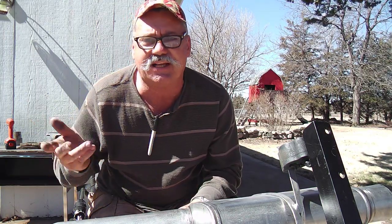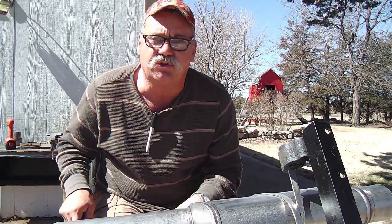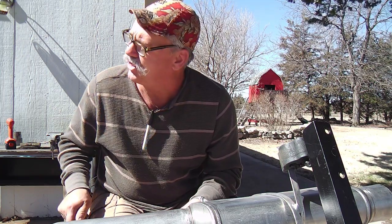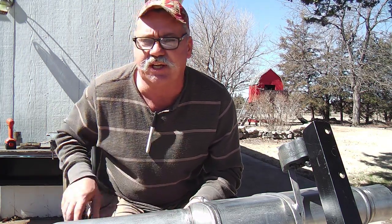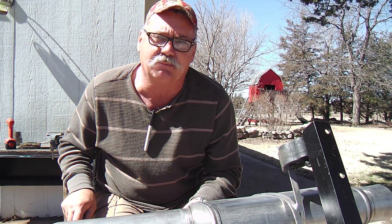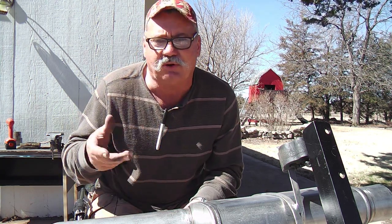There's nothing really wrong with the motor or transmission, but underneath it had some rust, so I did some rust treatment and painted a lot underneath and started refurbishing it kind of from the ground up. One of the things I did was refurbish the existing exhaust system. It had suffered quite a bit, and a regular mild steel exhaust system will rust from the inside out.